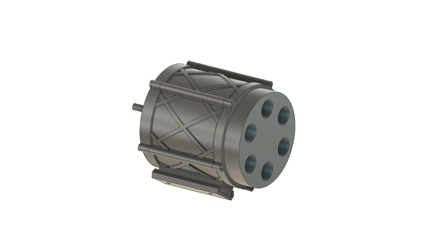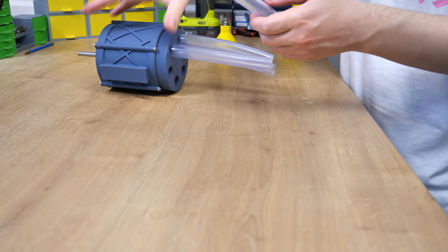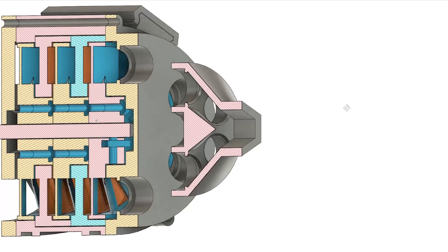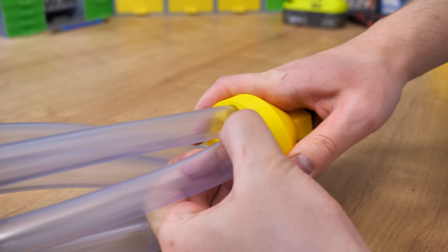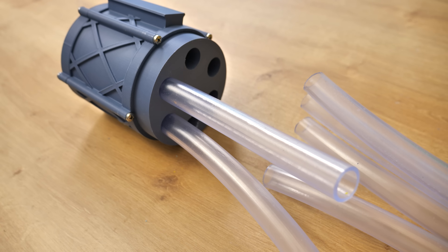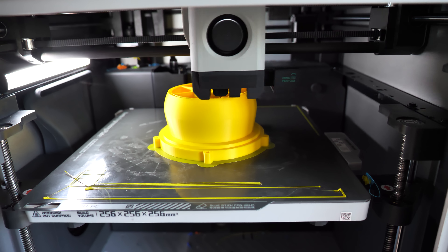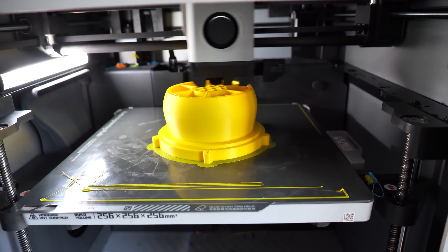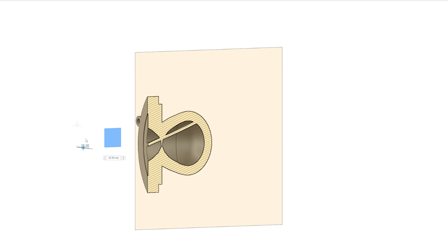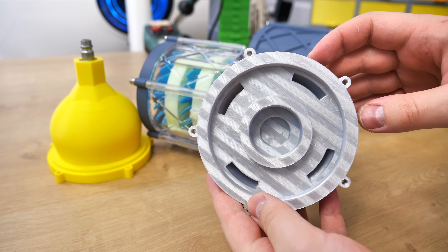So let's continue. First, the intake. Of course I don't keep this so unprofessional. The turbine front lid has 6 holes. My original idea was to connect tubes to the lid and to the other end a device that separates the stream of air equally to all 6 tubes. This was a terrible idea for many reasons and I scrapped it. So I came up with a way better idea — no tubes this time. In the lid itself are shapes that guide the air all over the turbine. The first redesign still has some design flaws, but the second one is way simpler and probably the best one.